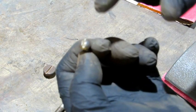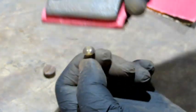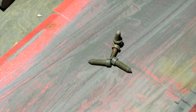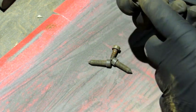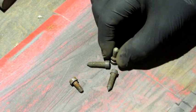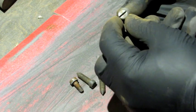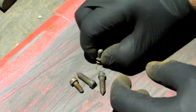A lot of times screwdrivers slip inside these slots and create burrs. I remove them with 150-grit paper on the sanding block, focusing your efforts on the burrs and working around the screw slot. I normally end up doing the entire head of the screw before going over to the wire wheel. For screws with flat tops, I go over to my lapping station — I don't want to round those tops over and don't want to take too much off. There's normally some type of machining mark on there and you don't want to sand them off, but if you have burrs or excessive rust, put them flat on your lapping paper and slide them back and forth.